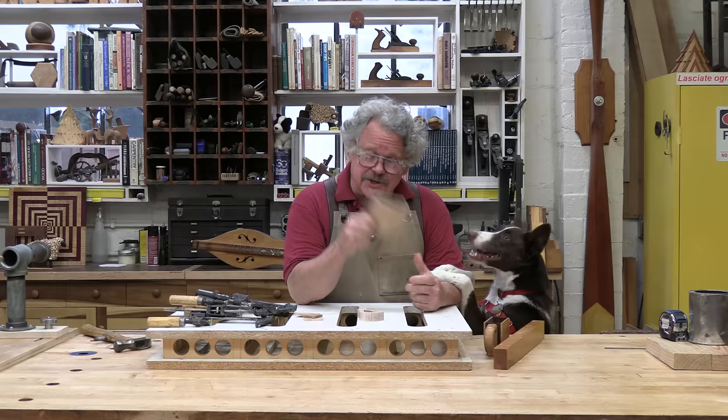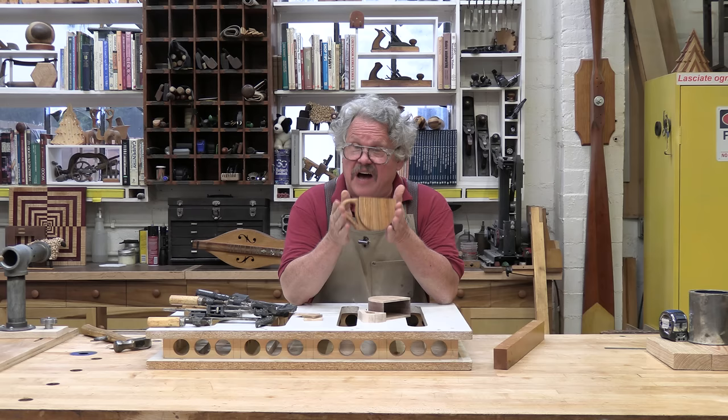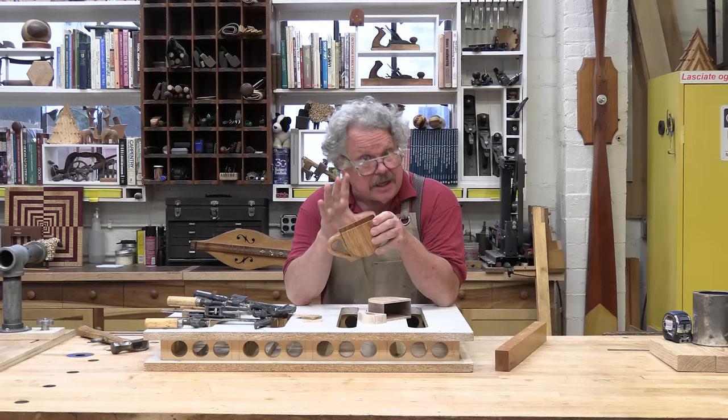I'm going to show you what I did using this piece I just made — I'm going to turn it into a precision scoop using a bending form. We clamp the curved part between the match plates to true up the curve, then glue one side of the scoop to the curved piece. Let the glue cure, remove the form, glue on the other side, cut the sides to size, add a handle, and you've got yourself a scoop. The plans for the heat bending jig and this scoop are available at the Workshop Companion General Store — the link is in the description.